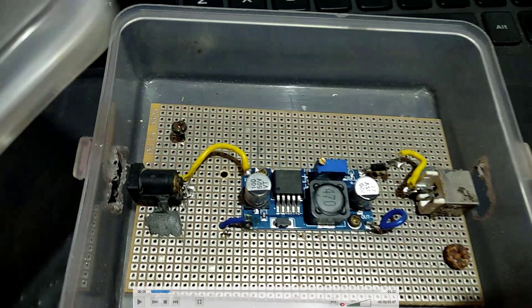You can see the main thing is this buck converter — this is basically a step down buck converter. I am using it to convert a laptop charger to a lead acid battery charger. If you are using a mobile charger then we will be using a step up converter, increasing the 5 volts to 13.5 volts for charging a lead acid battery. Also, several things used here are completely optional — materials like this box, this breadboard, and all these jacks for connecting the wires are completely optional.